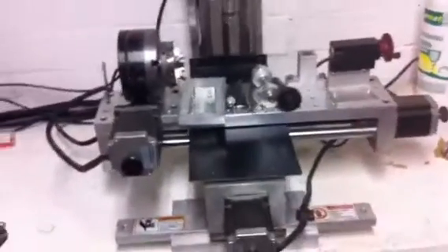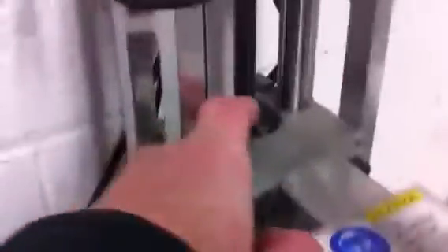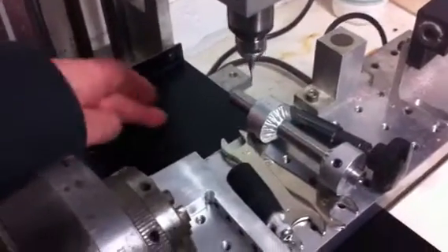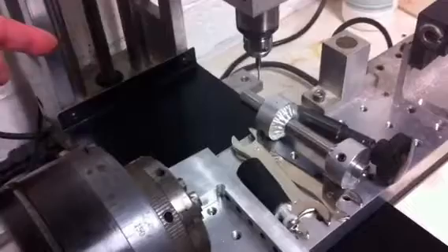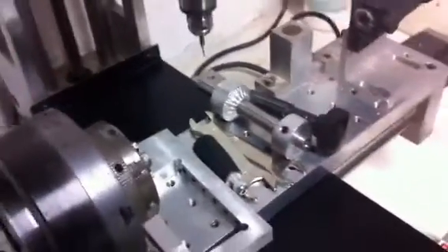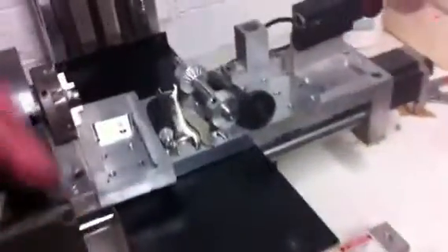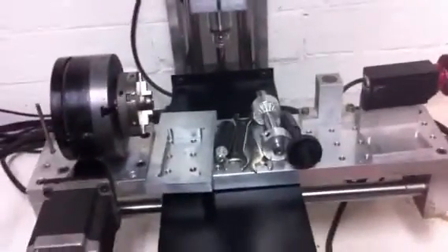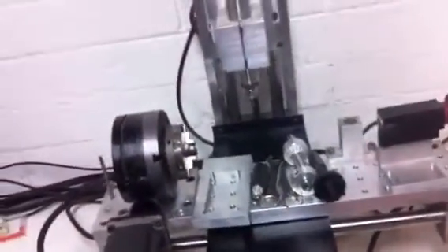When we do an actual home and probe, I think my anti-backlash nut underneath — which is a black nylon one — might have a little bit of wear or might be binding somewhere around there. So if you do a home and probe, it goes out by about 0.1 mm, and then you have to dial it in again. But if you park it at XYZ zero and don't drive all the way up to the top of the table, it seems to cut fine with no problems.